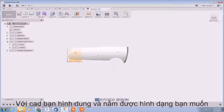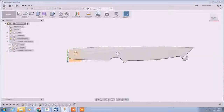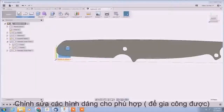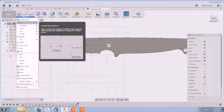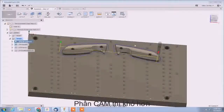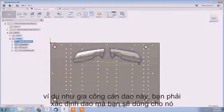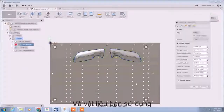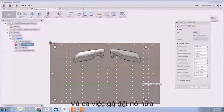The CAD part is conceptually straightforward. If you've ever used a draw program or a paint program, you get the basic idea — you draw a three-dimensional picture out of simple shapes and assemble it into something more complicated. CAD programs are full of weird complexities derived from the fact that ultimately they're intended to result in physical objects that take up space in the real world, as opposed to just making pretty pictures. The CAM part — the manufacturing part — is a little less conceptually obvious. Once you've come up with a design for something, like handle scales for a knife, you have to figure out exactly which tools you'll use on your mill to make it.